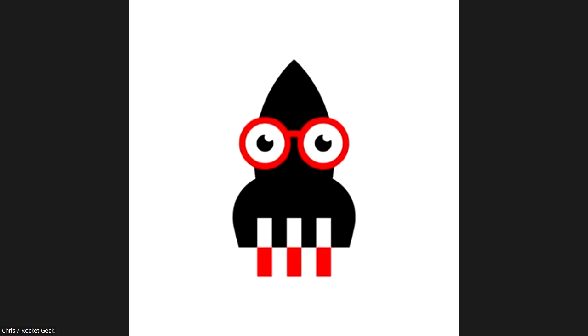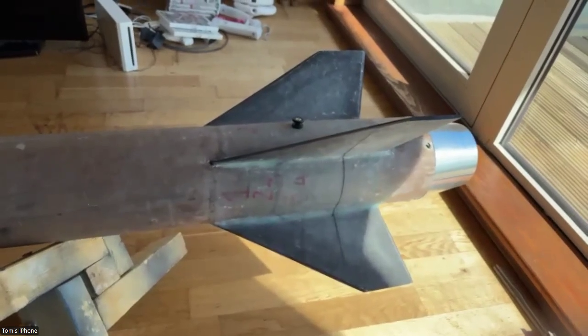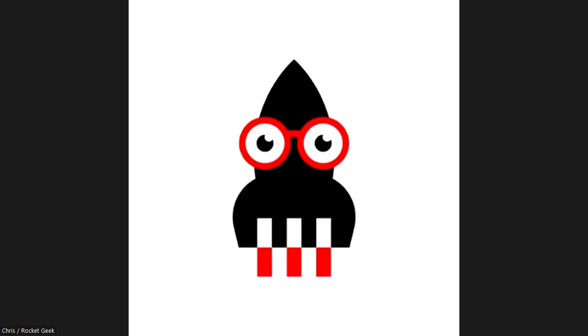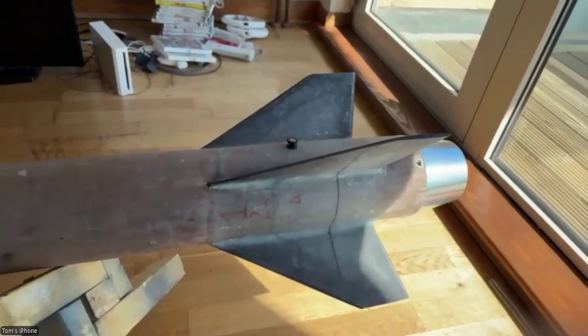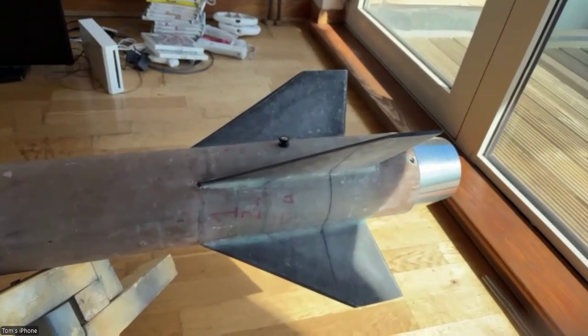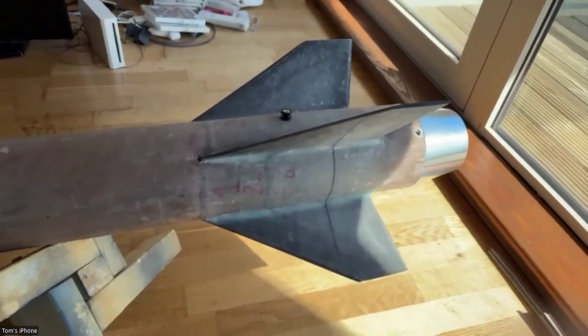Do you guys have any more questions on the fins, or should we move to the boat tail and the motor retention? Were they surface mounted, or through-mount? Through. Okay. And then seven layers of layup, varying thickness, so there's different damping ratios throughout the span. So we think both will survive calculations really well for that.